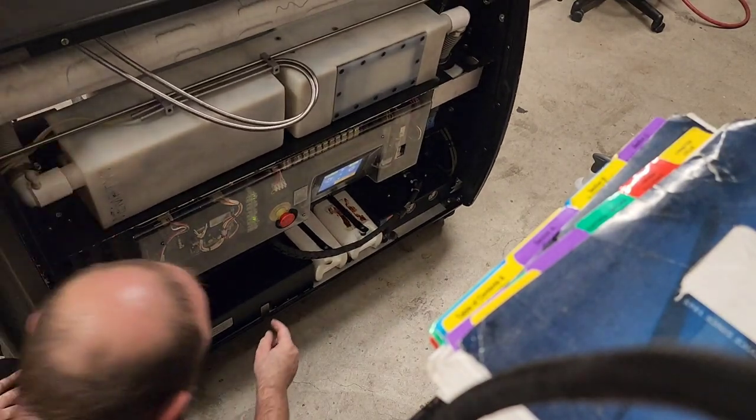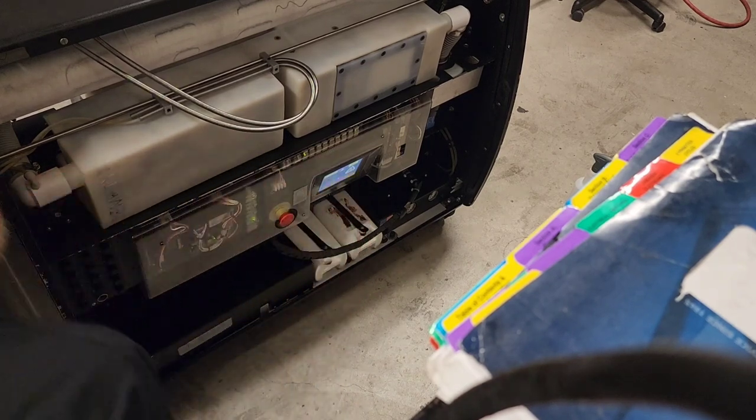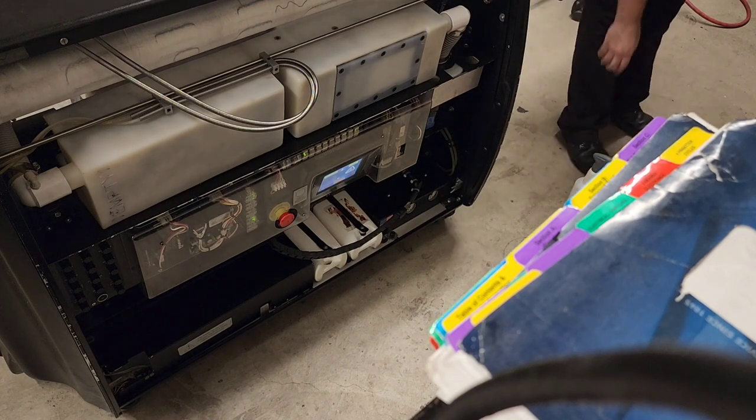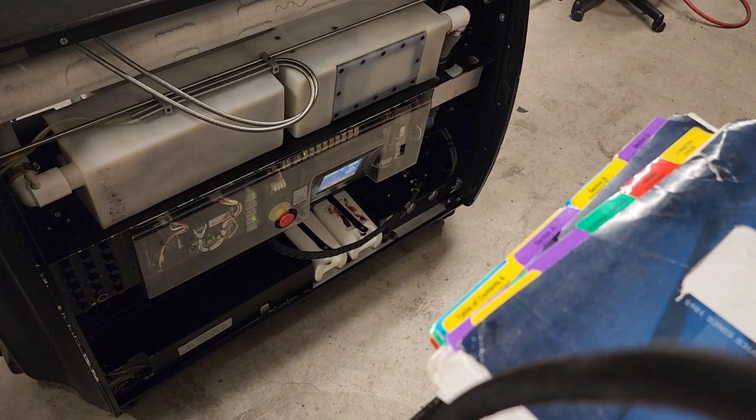And we're going to tell it to drive forward forever. We're going to give those motors about 5 minutes of runtime, just on their own, to help some of those brushes break in. Because we did drive motor brushes, we want to help break them in. If we hit either one of these whiskers, we'll kick the motor up into number two drive speed. Cool. So we're just going to let it run for 5 minutes on drive speed two, put lids on, call it done.